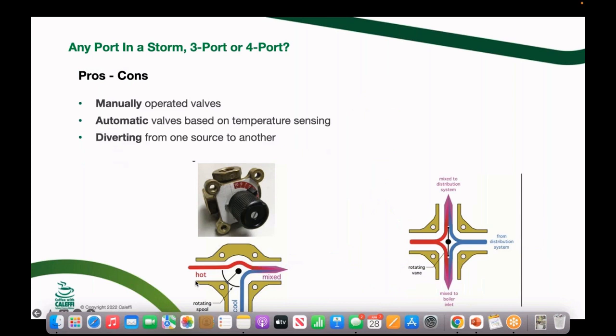Looking at the three-way valve on the left — I have different brands right here in my shop. There are bosses right in the casting where you take the knob off and put an actuator on, turning it into a smarter valve. On the right, we can add an additional port to the body to make what's called a four-port valve. With the three-way valve we have one blending point for hot and cold; with the four-way valve we have two blending points — we can mix the temperature going out to the system and also monitor the temperature going back to the boiler.